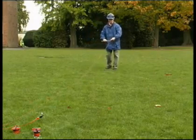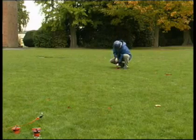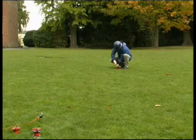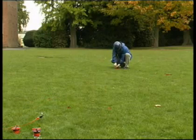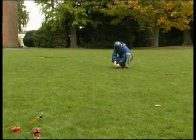The stakes should be placed in a straight line. The distance, calculated as A, between each stake should be the same. The earth stake should not be positioned in the soil deeper than a third of A.